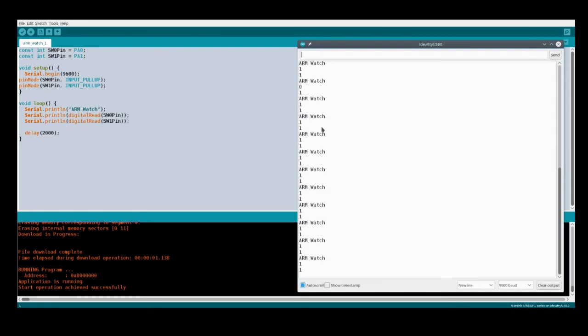So the next thing to do is to get the display working. So I'm going to port in to maybe this sketch the display code. So that's code that's got all the logic for initializing the display. So I'm using the 4-wire SPI here, which means there's data, clock, command data line, and a chip select, and that's all done with the display code. So I'll do that. It's quite a long job, so I'll just put it in there and see if we can get the display going.